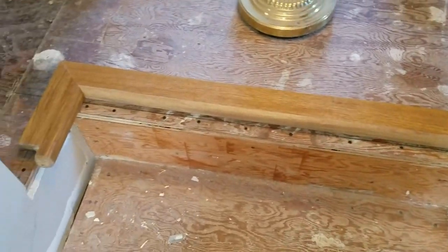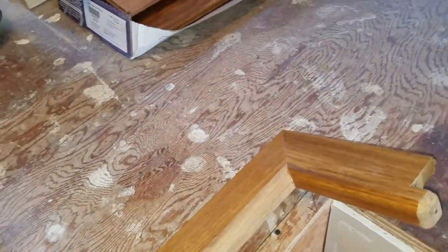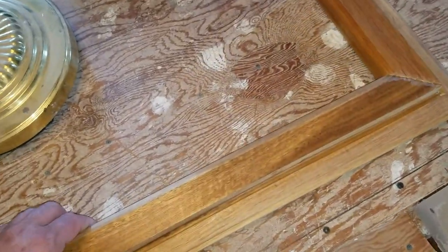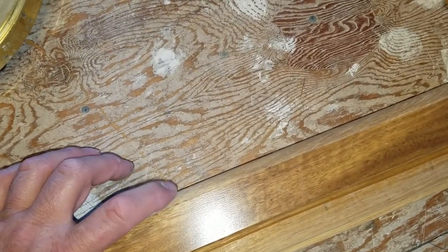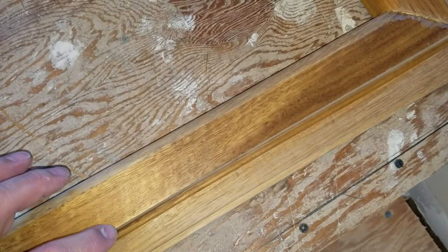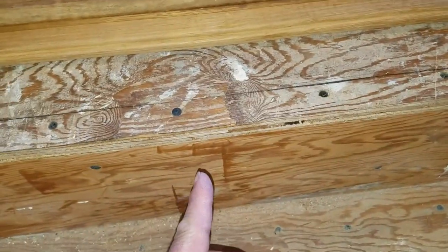The unknown mechanic and I just finished making this top bullnose for the stairway. This is all handcrafted. What we had to do was make a bullnose — we took two pieces of flooring, and on the bottom underside piece we cut the groove out of one end and the tongue off the other end. It is an inch and three-quarters wide.